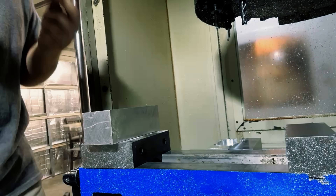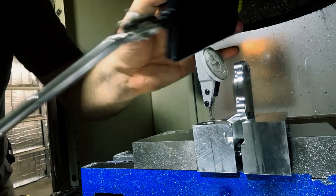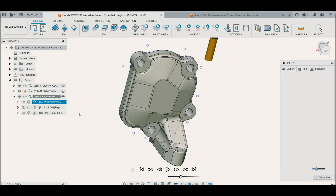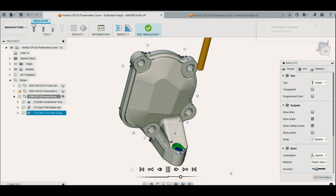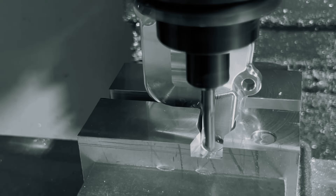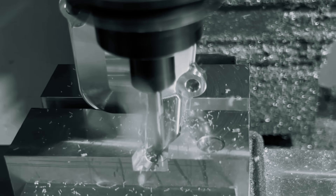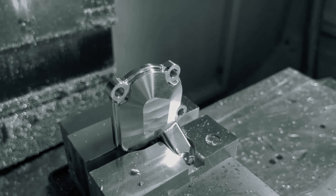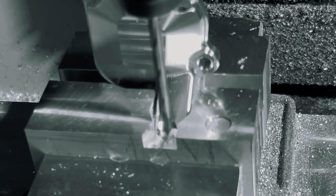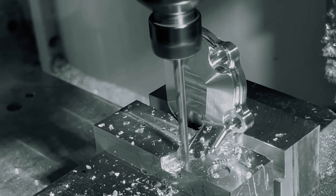It is time to set up Op 3. I installed my already-machined Op 3 jaws into the vise and indicated my special machined jaw feature that I designed in CAD and incorporated into my part program. With my work offset set, I set my tool plane on top of the jaw and will machine Op 3 the same way as with the aluminum prototype in my first episode. First, the mounting bolt head face is cleaned up and machined flat to prepare it for the quarter-inch 90-degree spot drill. The spot drill dives deep enough for the hole to have its own chamfer at the top. Finally, the appropriate sized jobber drill pecks down into the magnesium until it leaves a perfect hole — and it is finished.